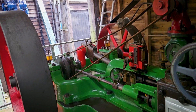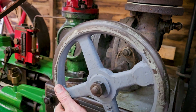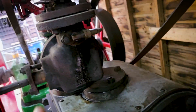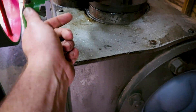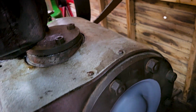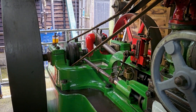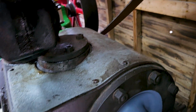Over to the marshal. It doesn't have steam jackets on it but we just crack it open a bit. Just enough to send steam down here into the steam chest, which is here. There's a slide valve in here. Once this gets warm it tends to heat up the cylinder. Chances are it's mid-stroke at the moment, so the valve will be open for at least one of these cylinder ends now. So we'll start warming up from there as well.